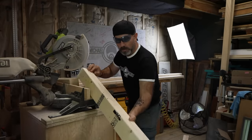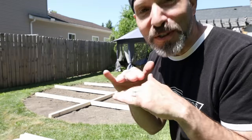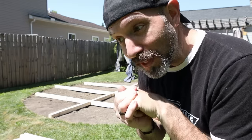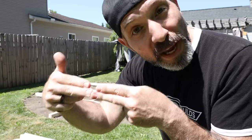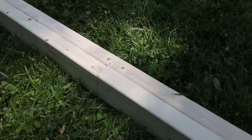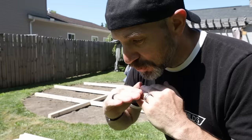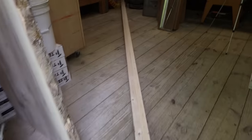As far as the main spine was concerned, there's no way I was going to find a 16-foot board straight enough for this frame. So I ended up butting two 8-footers together, scabbing them with another 8-footer, then adding one 4-footer on each end. Straightest 16-footer I have ever seen.